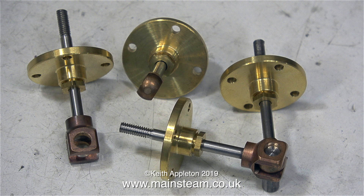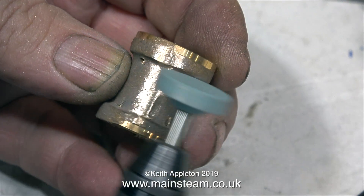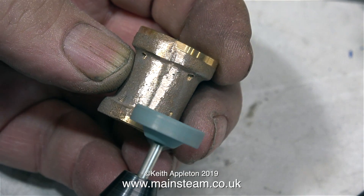So am I being a bit too picky with this job? No, definitely not. However small the burrs on the shafts are, if they can't be fitted smoothly into the bearing surfaces, the burr is going to scratch the bearing. Little jobs like this are very necessary and they're all part of the main job which is called fitting. And this is called fettling — power assisted fettling.